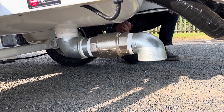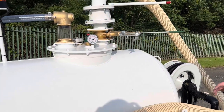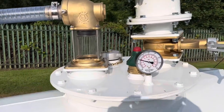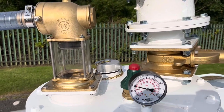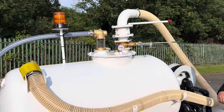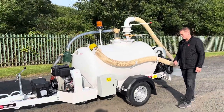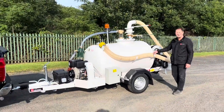When you want to clean out the effluent side, there's a three-inch cap and chain at the top — open that up, put your pressure washer in, open your four-inch discharge valve, and wash out the effluent side of the tank.